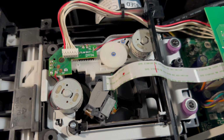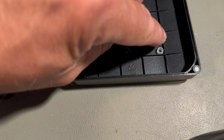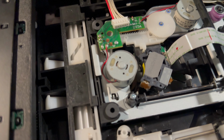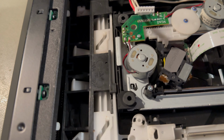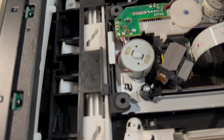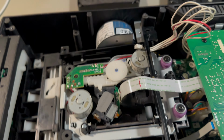Okay, I took off the ribbon cable here and loosened the two screws. One thing to be cautious about here, there are two spacers beneath these 2 points. Otherwise, it looks now that the drive can easily slip out. Just take this off here, so I can get the cable out here. And then the drive should slip out, I hope. Okay, I'll get this off in a second.